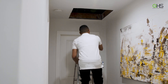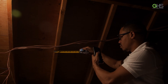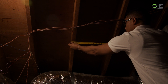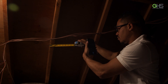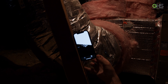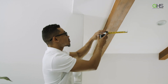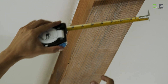So now we're in the attic. This is the part of the structural survey that we need for the structural engineers to make sure that the roof can handle the extra weight. We need to measure and take pictures of the trusses and rafters. Spacing should usually be about 24 inches to the center — we need that measurement and a photo. You will need to measure the size of the rafters, like 2x4 or 2x6, etc. If you can't get into the attic or it is really small, sometimes there is an overhang of the roof on the outside and you will see the rafters there. If there isn't an attic but you can see the exposed beams inside the home, measure those as well.